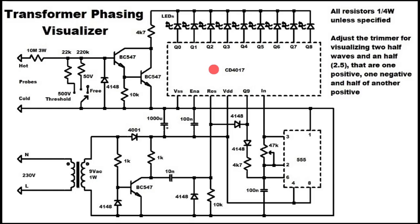For the US it will be 30 Hz instead of 60. There's also another diode and resistor that keep the 555 in a reset state, because if the 555 free-runs without synchronization it won't be in sync with mains, causing one of the LEDs to flicker. This diode-resistor charges a capacitor and keeps the 555 in reset when Q9 is high. That's basically it — thanks for watching and bye.